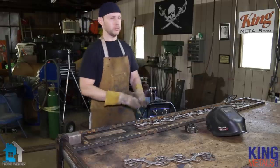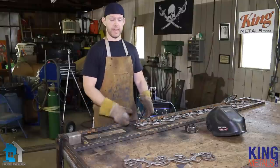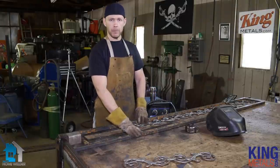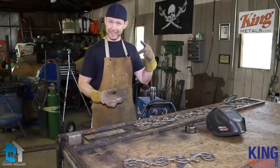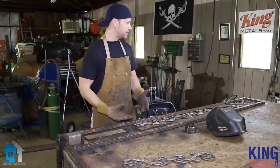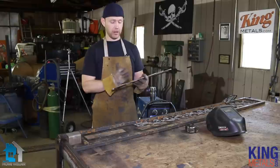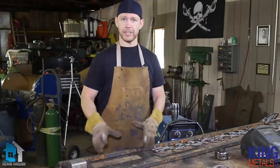The first thing we're going to do is weld together our frame. Remember in the previous video, the first step is to actually build the rectangle instead of using the castings as our base. I wanted to lay everything out just to make sure it was going to fit, and what I discovered is based on the height of my frame, I'm going to have to take an angle grinder and cut off a section of one of these pieces.